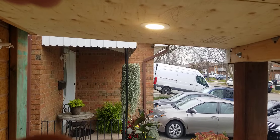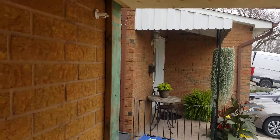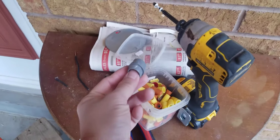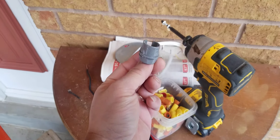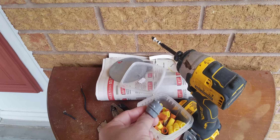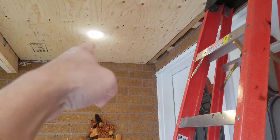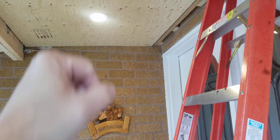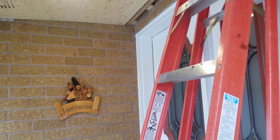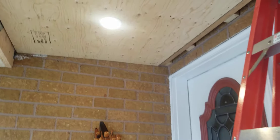— the box inside the recessed light: when you're running wire, you should have a grommet. You only need one for one wire, but the one where you're running a wire in and another wire out to the power, you're going to need two grommets — one going in and one going out. That's how you do it.